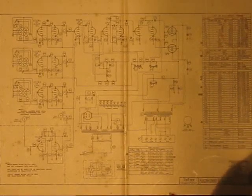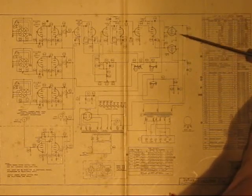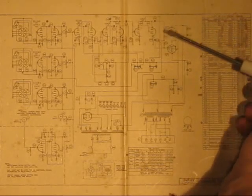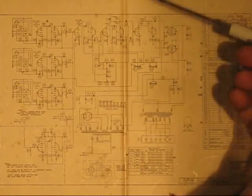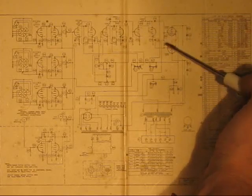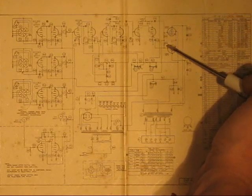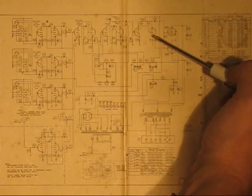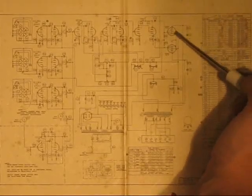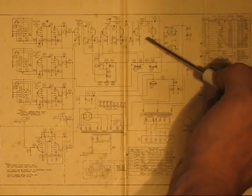On the Motorola amplifier, you know, in this amp, these are the outputs. They're 5881s. Think hyperactive 6L6s. On the Motorola amp, I attached this modulation directly to the grid of the phase inverter for the output tubes, directly to that grid. In that case, though, the output tubes are 6V6s. The phase inverter is a 12AU7. In this case, again, these are 5881 6L6s on steroids, and this is also a 12AU7.